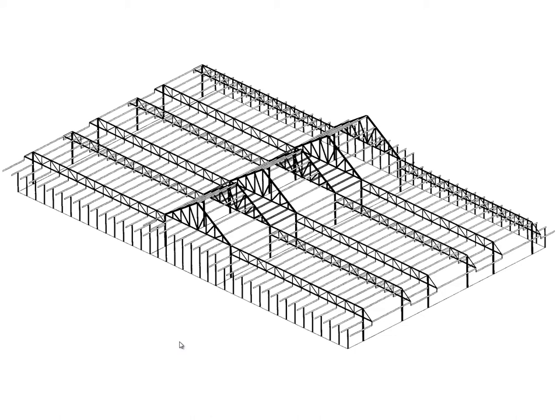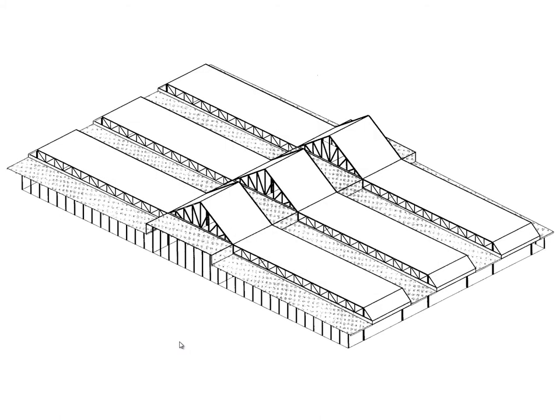For any given zone the glazing area should be about 20% total, meaning the area of north and south glass combined equals about 20% of the floor area. This shows the lower roof and upper roof alternating. Notice there's a slope to get water off each zone. In this scheme the central portion slopes so that water runs off each side down into the gully constituted by the lower portion of the roof.